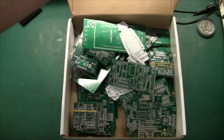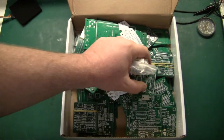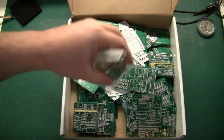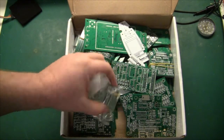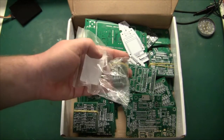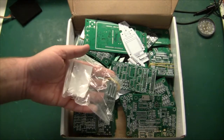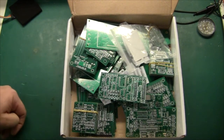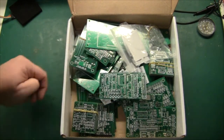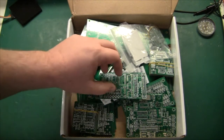In this bag here I have all the little pods. The cable from the emulator goes into a pod and then into the board itself that you are developing software for. They're based on little zero-ohm resistors on this board. This one can emulate all the way from 2K — 2716, 2K by 8 EEPROMs — up to 512 kilobit EEPROMs.